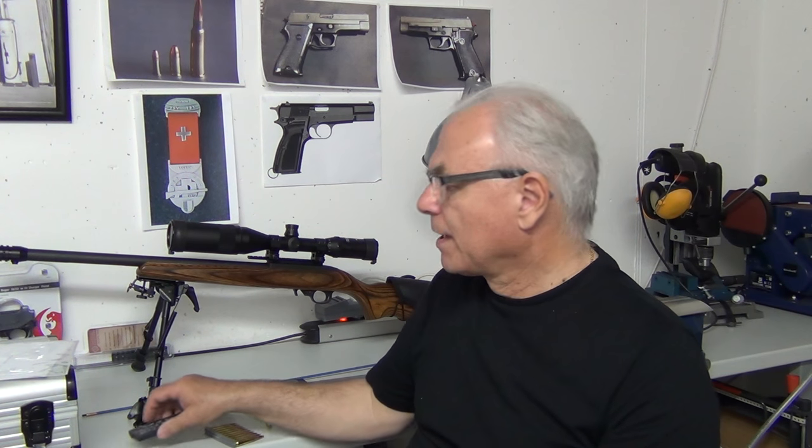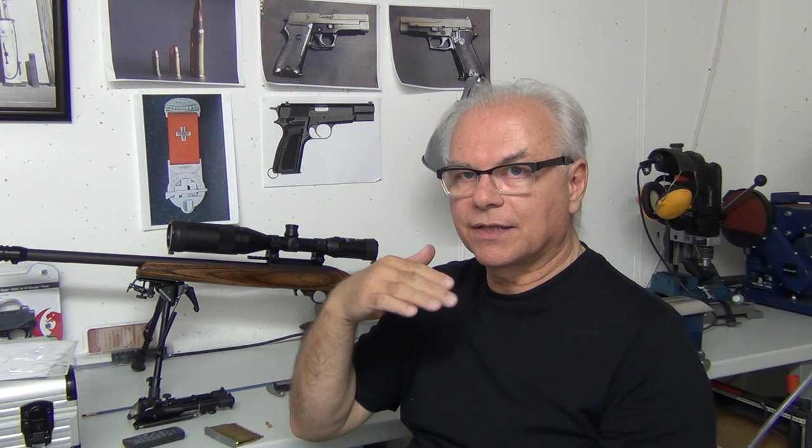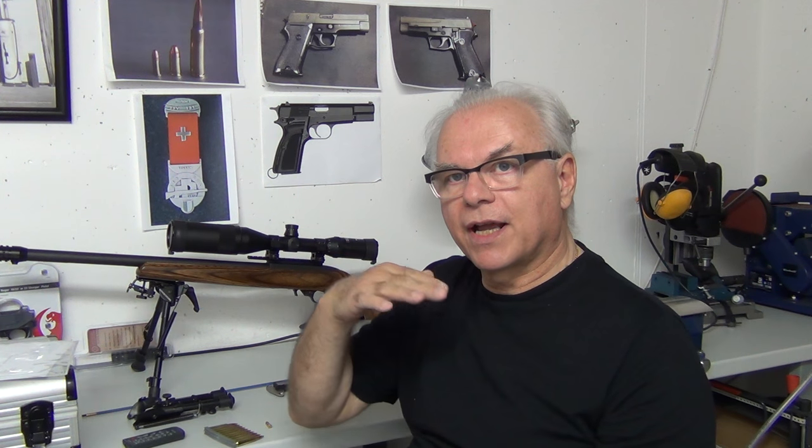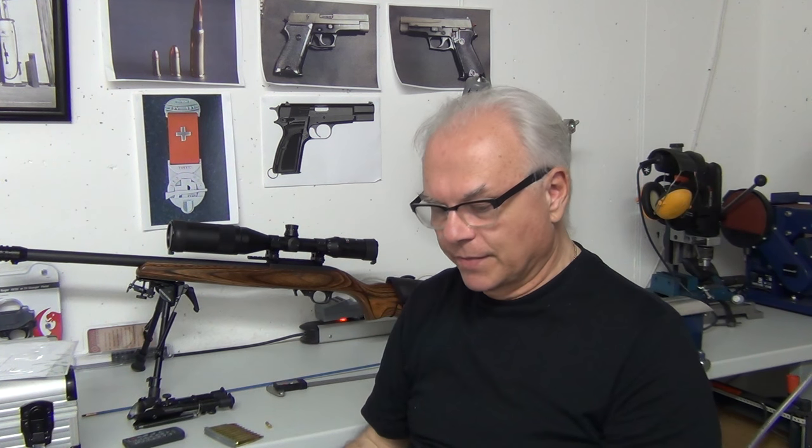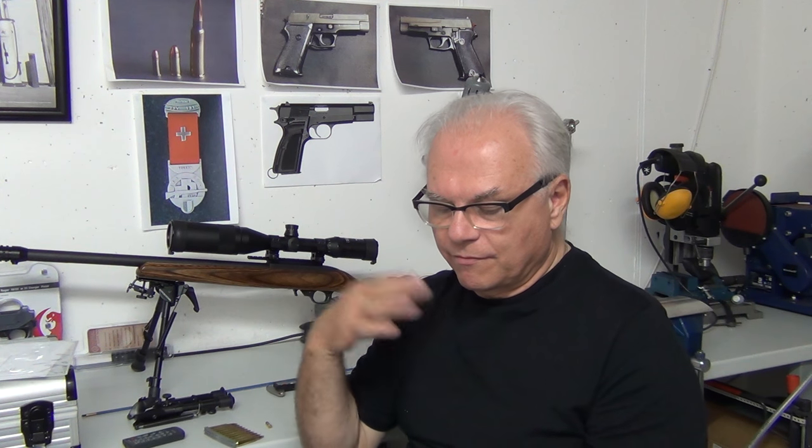The next one may well be, and I haven't decided about this, whether to radius the bolt at the back where it pushes the hammer down. Those of you who know the mechanism of the Ruger trigger mechanism with the hammer know that the bolt comes back, pushes the hammer down to reset the trigger. And then, of course, you can pull the trigger again. The hammer goes forward on the bolt, which has been sent forward. The bolt is sent back by the gas, or the recoil of the 22LR cartridge. So I may radius the bolt, I'm not too sure about that, or I'm considering I might buy an aftermarket bolt, because then the breech and the spacing will be correct, it'll be nicely squared off and everything, and that's probably going to be a nicer finish than the stock Ruger bolt.